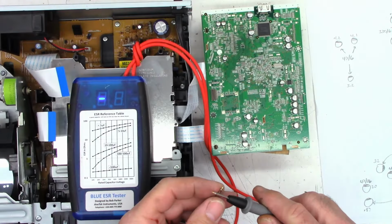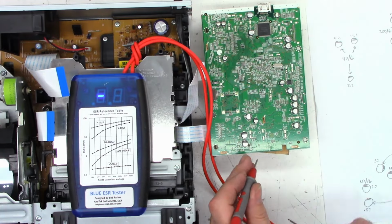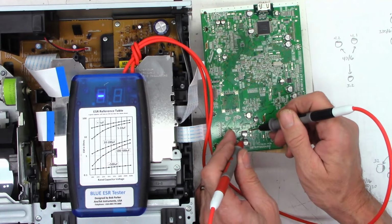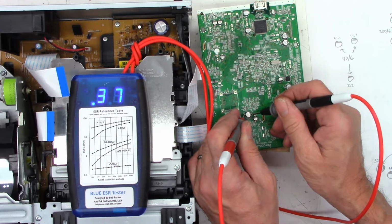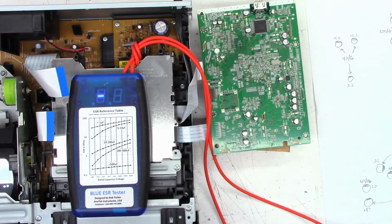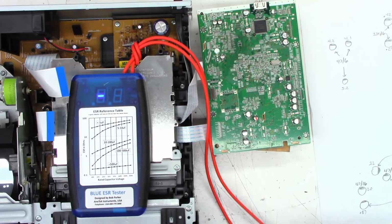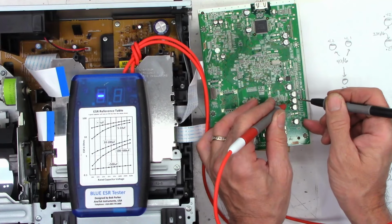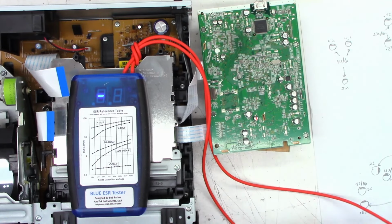One moment. All right, so ESR meter is out. I do have it basically zeroed. Pretty close. So let's start with the 3030s right here. 0.84, that's pretty good. 47 at 16, 2 ohms. I'm okay with that. 330, 0.33, that's good. 47, 4.3, that's a little bit high for me. .31, good. 0.33, good. 0.26, better than good. 0.93, just a hair high. We'll mark that one.